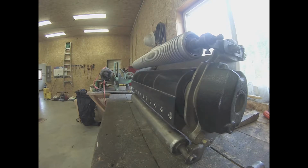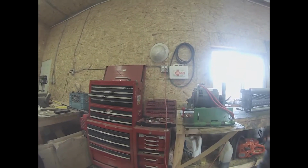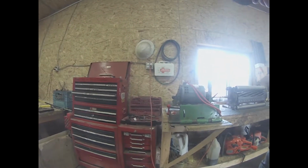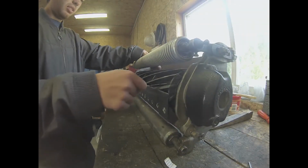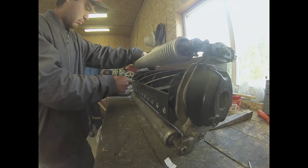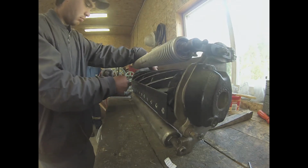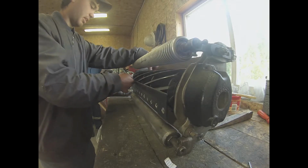When it comes to backlapping, it may take a few minutes to sharpen the reel's bed knife, depending on how dull your bed knife really is. After about 2 to 3 minutes, I like to check to see if the reel is cutting paper to our course expectations. I will check each side of the bed knife, and the middle with the paper. If one side doesn't cut paper, that is telling me that there might not be even contact with the bed knife, and I may have to do some adjusting.